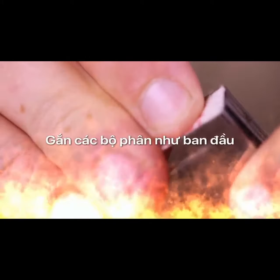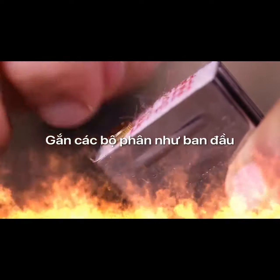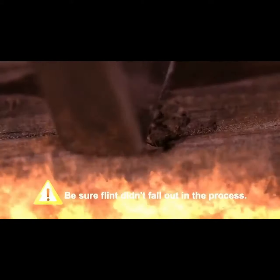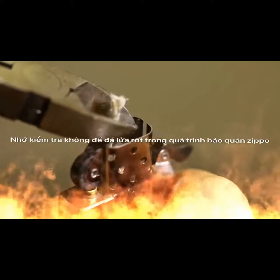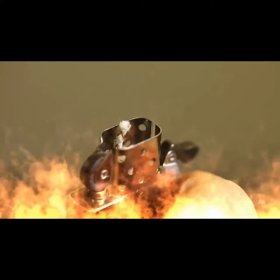The goal is to make sure the wick has as much contact with the packing material as possible. Reinstall the felt pad over the flint tube and secure it with the flint spring as previously mentioned. Be sure the flint didn't fall out during this process. Trim the wick evenly with the chimney height and reinstall the insert into the case.